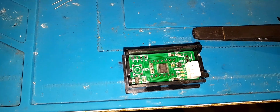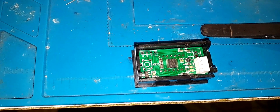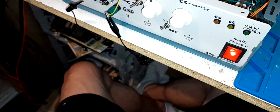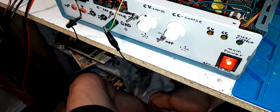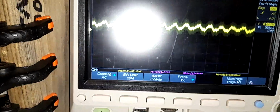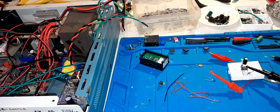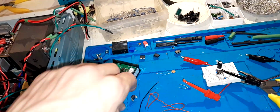But obviously it wasn't designed to work in different environments very well, if it just breaks out into oscillation in such a clean and simple circuit like this. I mean, seriously, I've got wires hanging out the case, leads hooked up everywhere, bringing noise in, and we're still only at 85 to 90 microvolts. Yeah, just ridiculous. Everything in this power supply is all quiet.